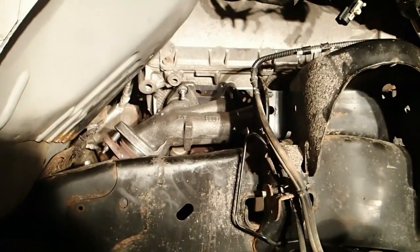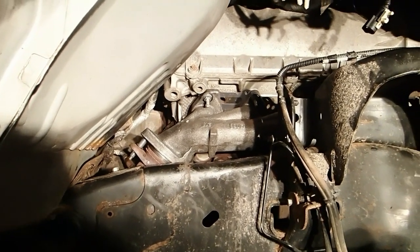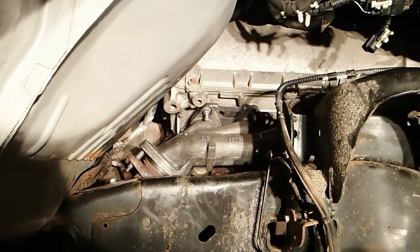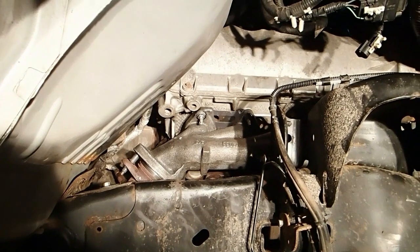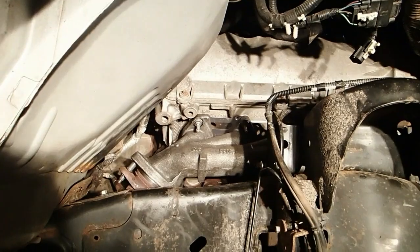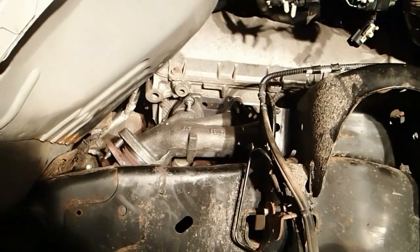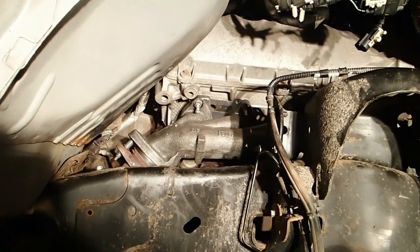Alright. So what I'm going to do is let this thing run a little bit and warm up, and then I'm going to go ahead and tighten all of the studs back up again, so they settle in good. A little bit of heat and they'll settle in real nice — I just think it's the smart thing to do. Probably some armchair mechanics say you don't have to do that, but the last time I did manifolds I did that and it seemed to work out pretty good.